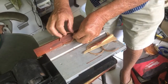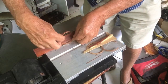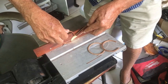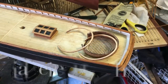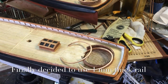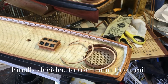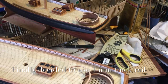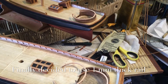Now we are going to put it on the jig and split it. We're setting it up at 2mm, being very careful, and it works fine. For both models we did two thicknesses for the cap rail of the cockpit — the first at 2mm thick, the second at 1mm thick — and the preference is to use the 1mm thick cap rail.